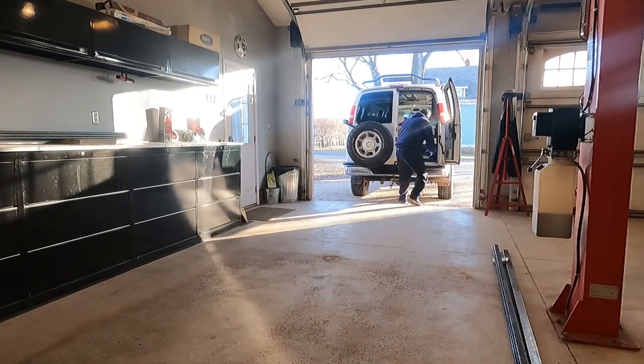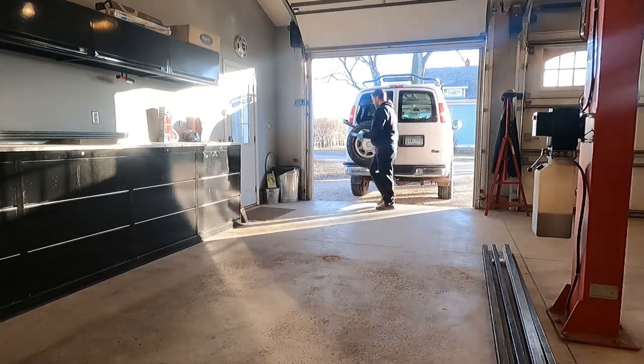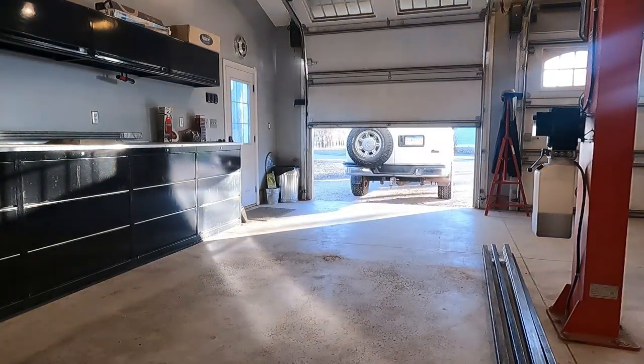For the center spine of the trailer, I went with a little bit thicker steel. I chose 3/16-inch. In hindsight, I think this was overkill. It just added extra weight, and I'm not sure if it gave any extra strength.